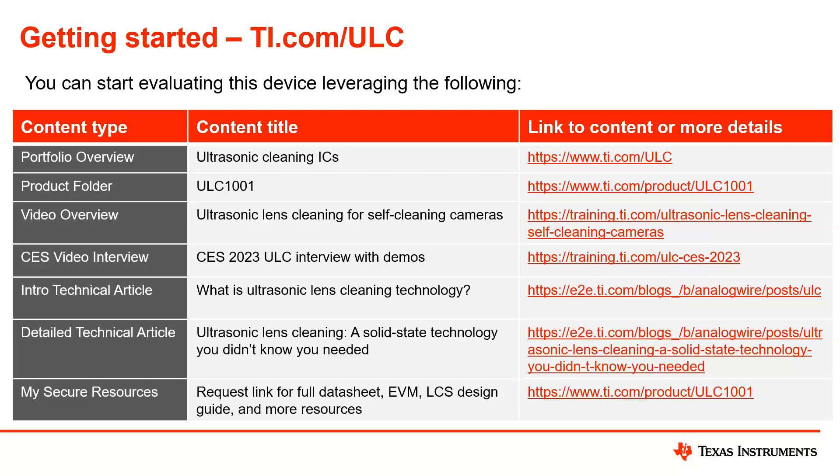Question: What are typical applications? Are there applications other than cameras? Absolutely — this can be used in any type of camera or sensor where there is a lens we can vibrate to expel contaminants. The first market this technology was developed for is camera lenses, but we are also looking into LIDAR and other roof sensors. We've had early discussions around automotive applications. Really, this could be implemented in a wide variety of applications, not just automotive, but in manufacturing and industrial settings as well.